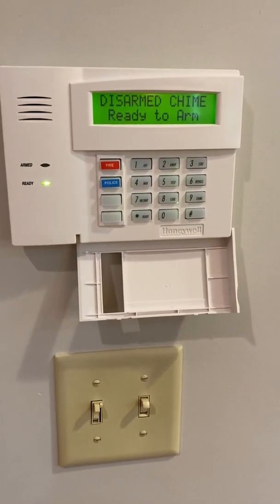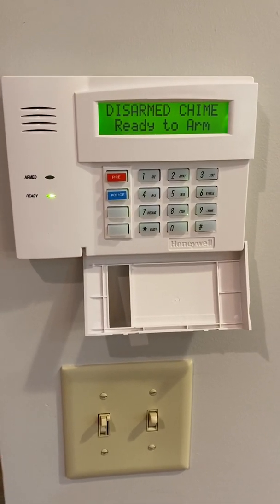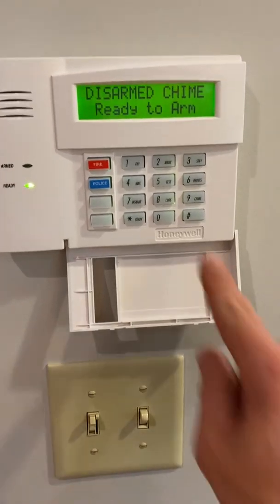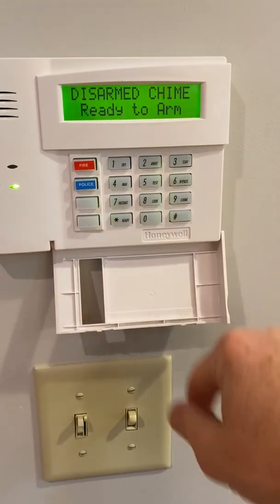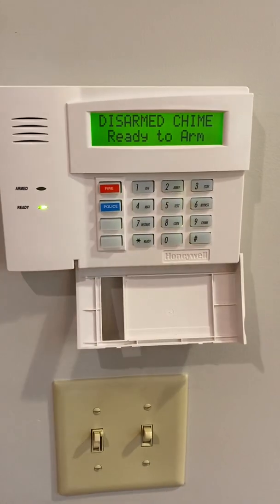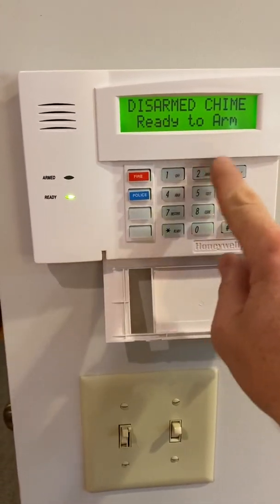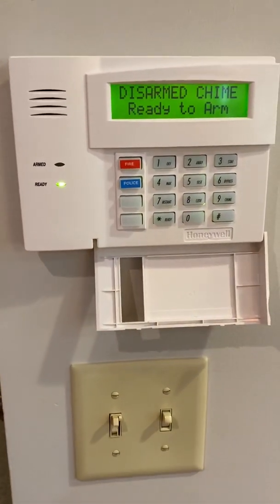If you want to delete slot number 3 as construction ends, or maybe somebody else got a code and you want to change it, you delete and re-enroll a user code. So let's delete the user code. You enter the master code, 803, pound 0. Now 1212 off no longer works. If you want to add more users, you would enter your master code 1234, 8 04, 805, 806, and so forth and so on down the road.